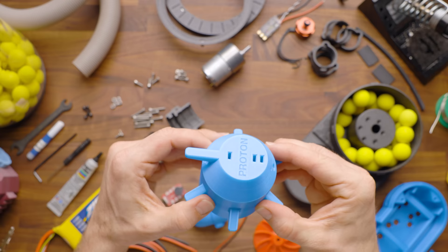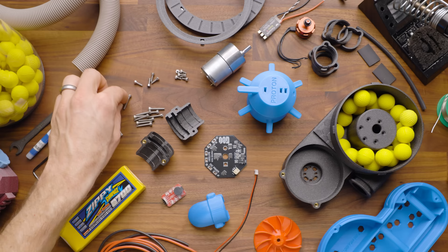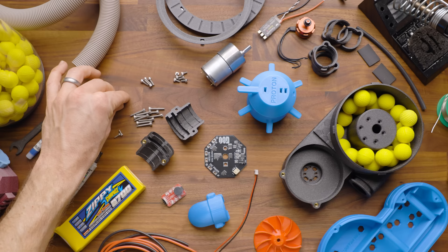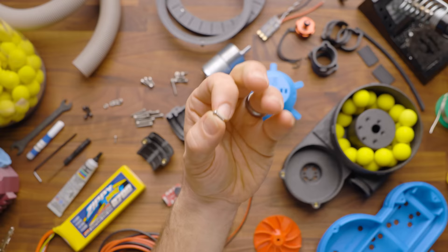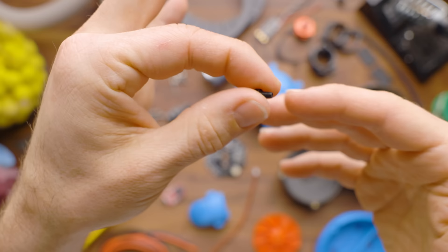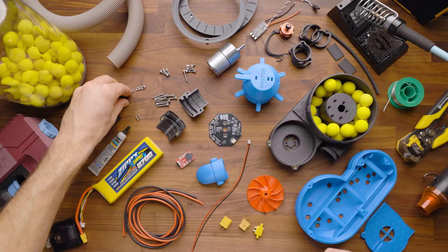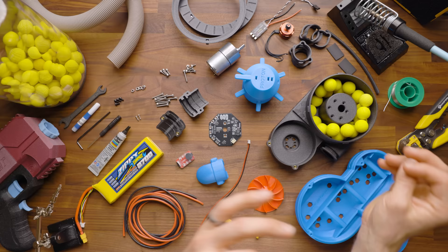Inside the auger there should be three screws in the bottom — you'll find either 20 millimeter screws there or you will have 20 millimeter screws separately. There are also a number of 10 millimeter screws and 6 millimeter screws along with square nuts. An M2.5 by 8 millimeter screw is only for the XT60 mountable connector. Four small black screws in the 6 millimeter length will be used for the brushless motor. I would really recommend you take the printed sheet that comes with the kit and verify that you've got everything, because we may alternate what hardware is pre-installed versus not installed.